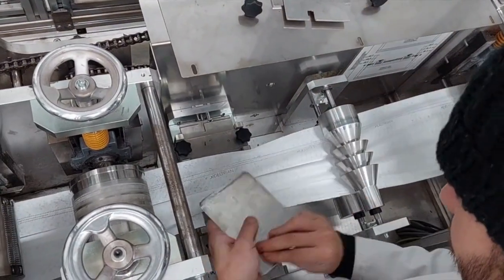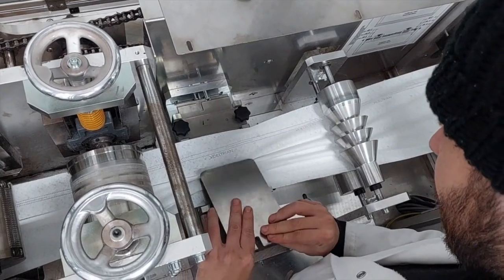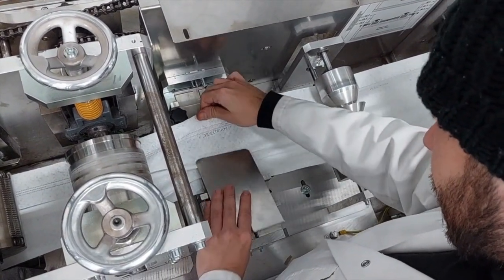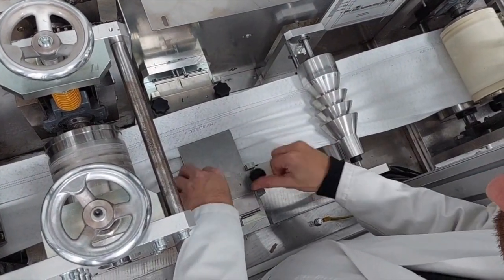Another lesson to keep in mind, especially in robotics installations, is that you have physical limits. Typically the jaws and grippers that we use — unfortunately, to this day there is no universal global type of gripper, so you always have to adapt it to the kind of part you need to move. The bigger the size differences are, the more difficult it will be. With the face mask example, we had issues to solve due to the difference of thickness within the mask, and this took quite a lot of time.